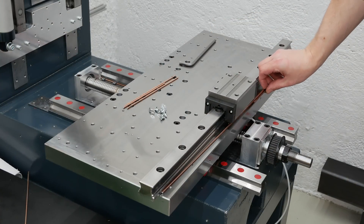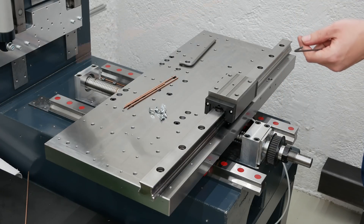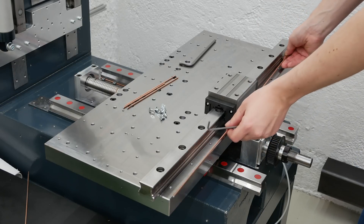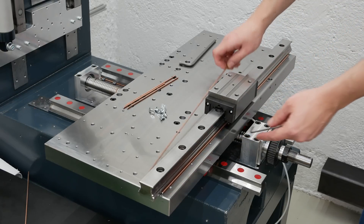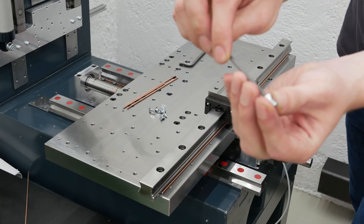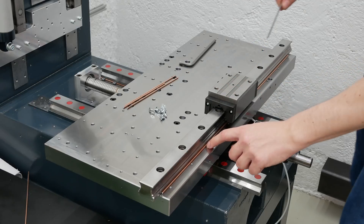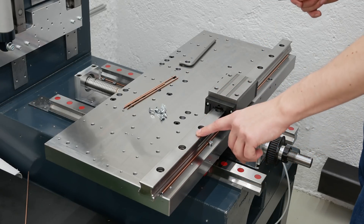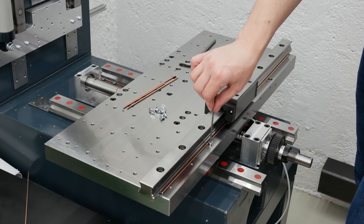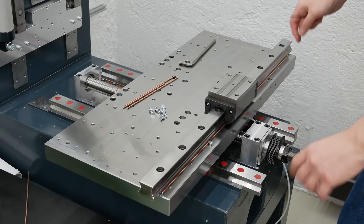To make it a little bit easier to align these two rails here, I will use the same method I used with the other rails. I will take this 3mm steel rod and put it next to the rail and also on the other side. Then I have flathead screws that will go into these threads here, and those flathead screws will push the rod against the linear rail. That way I should be able to adjust the position of the rail very precisely, and it's also wedged in between so it won't move anywhere.